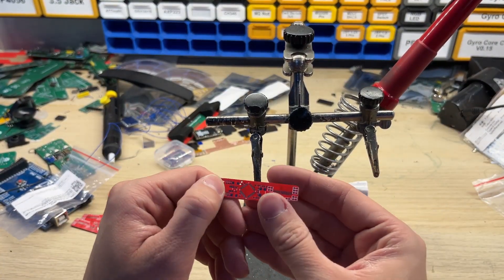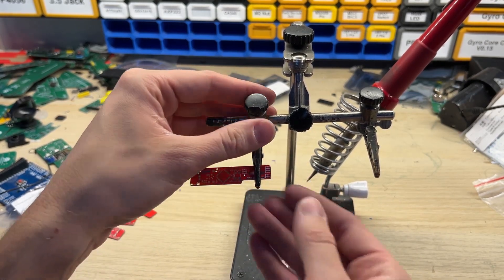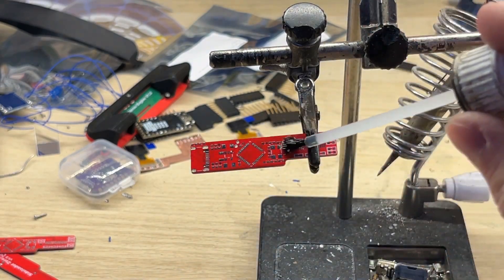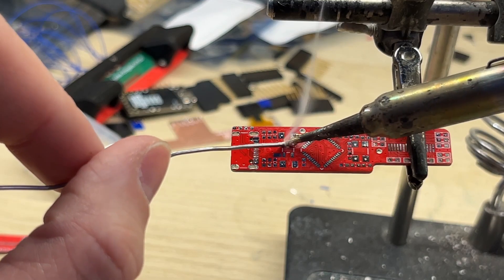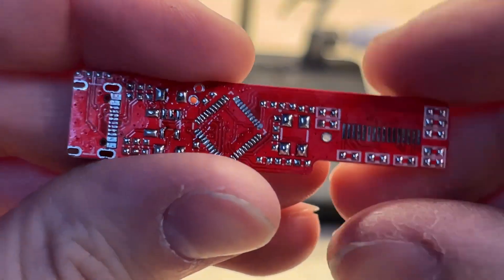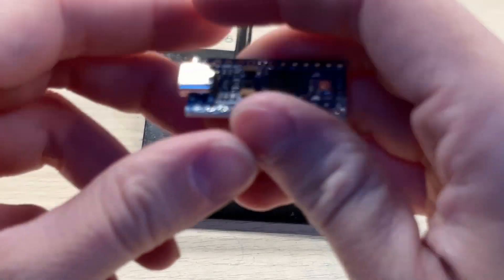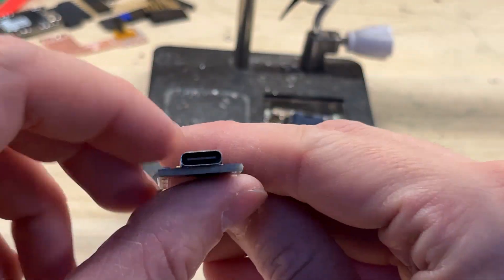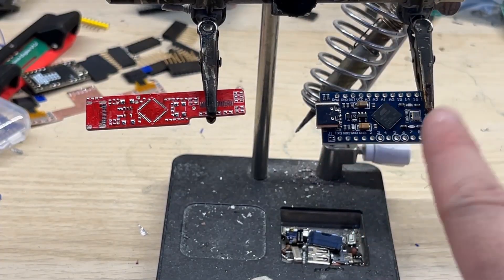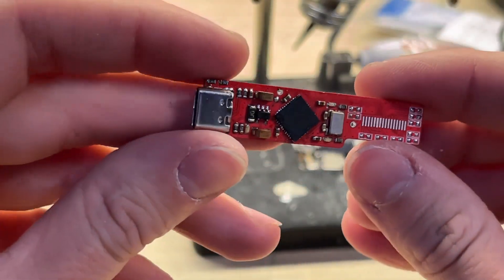So now let's assemble it. First I will mount it on my holder and cover the whole board with flux. This will make the soldering way easier — the flux basically makes sure that the solder goes where it needs to go. After the whole board is covered, I can now cover all of the solder pads with solder. After carefully applying the solder, it should now be ready to transfer all of the components. The absolutely easiest way to assemble this board is to simply transfer all of the components from an Arduino Pro Micro. The whole board layout is pretty much the same as the Arduino Pro Micro. And now the microcontroller part is finished.